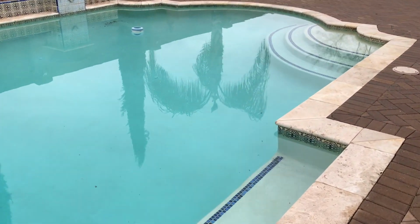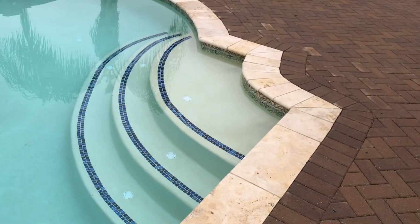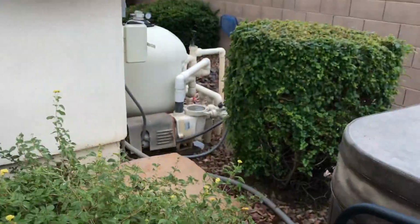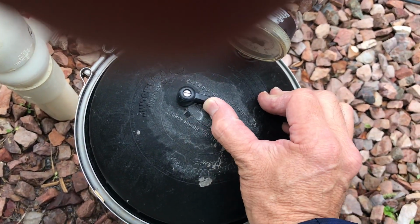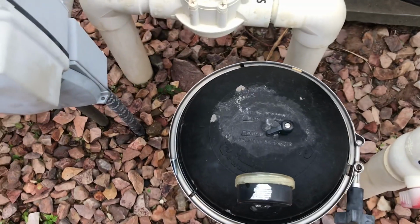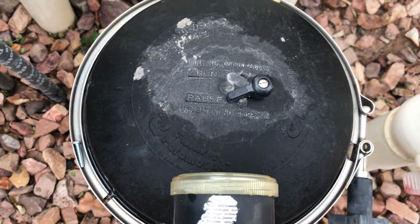But what I would do is watch them cycle. As soon as I saw it start to cycle to the steps, I would run back to the pool or to the actuator, and I would move this toggle to pause. Okay, I'm shutting it off so you can hear me. I would move this toggle to pause while the openings are on the zone that is the steps.